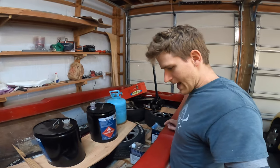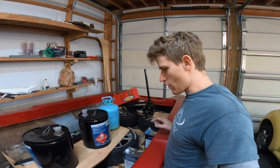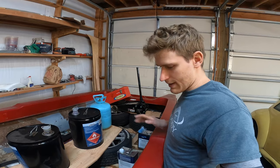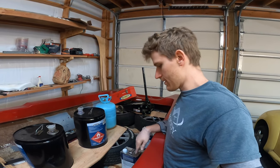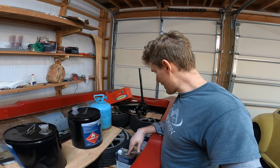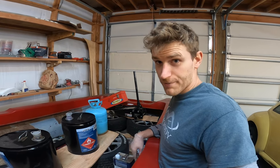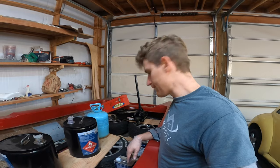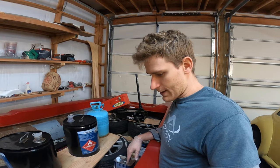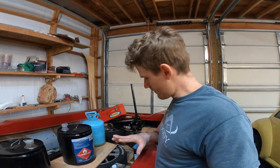All right, so I have all the stringers installed. And once again, I have all the weight on top of the stringers to keep them pressed into the floor. Hopefully that will give it that tight fit to the hull. And when it's completely dry and cured, it will hopefully not have any gaps between the floor and the stringer. So it's exciting to get that all done. I'm gonna let it all dry. Probably take a full day to let it dry and cure. And then I can plan on getting all of it fiberglassed to the hull.